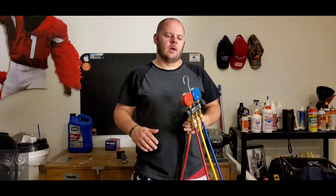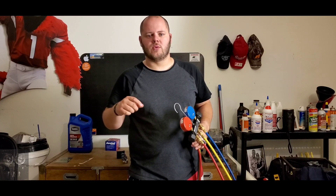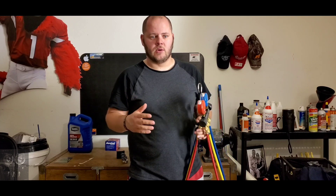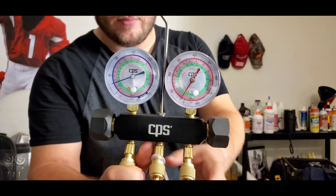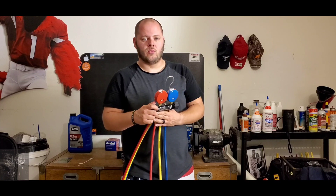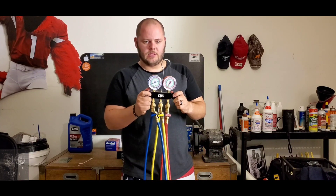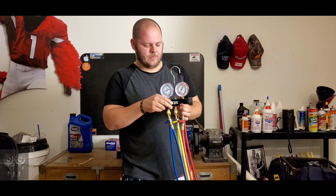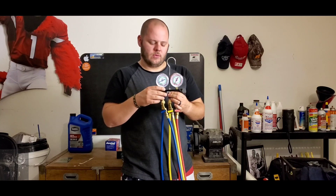While editing I realized I forgot to teach one last step of the purge and sweep process — it's called de minimis. De minimis means you're going to release a very trivial amount of refrigerant into the atmosphere up to the legal limit. There's still a little pressure on my manifold, so I'm going to release that. Open the manifold on both sides using the knobs — this allows all the excess refrigerant to collect into the middle of the manifold including the hoses.